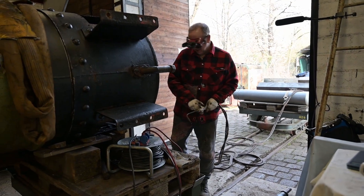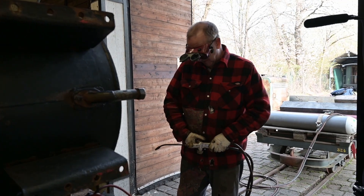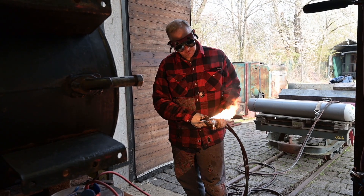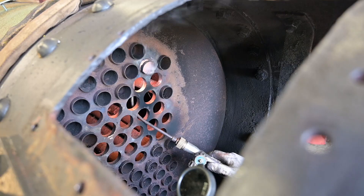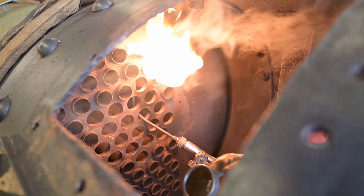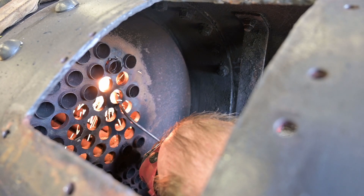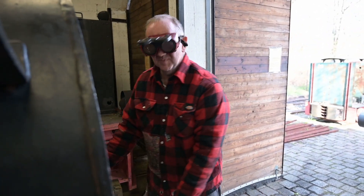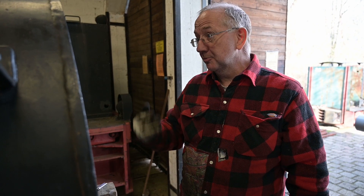What I'm going to do — it's actually an acetylene torch, not a cutting torch. But we're just going to turn up the oxygen so we oxidise and melt the tube. Here's the next step. Now what we do is put some more pressure on or use the hammer to push the tube this way, so it comes loose.